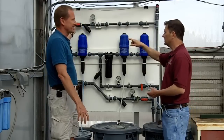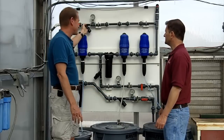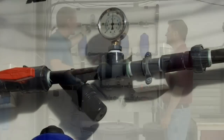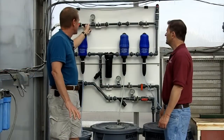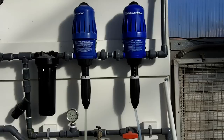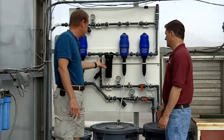We're bringing our feed water in here, which is just tap water — potable water that we use at the greenhouse. We filter that initially so that if there are any particulates in that feed water we can get those out of the system. We move it on down to the first injector. These are water-driven, so the flow of the water drives the piston and injects the nutrient solution — basically like a syringe, taking up a little bit and pushing it into the water stream. It then goes to the next injector, which takes the next solution and injects that, and then it gets mixed.